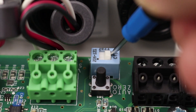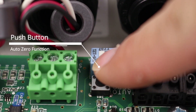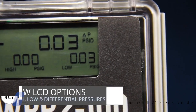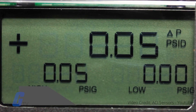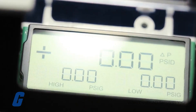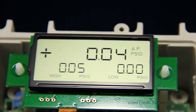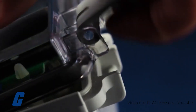The AWPR-2 also features a push-button auto zero function for remote calibration. The LCD option will display pressure values for both high and low side pressures, a differential pressure value, OVR for values over the specified range, error for differential pressures out of range, and zero when the auto zero is in process.